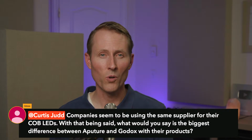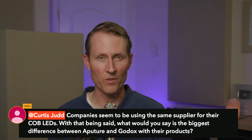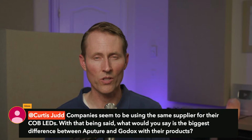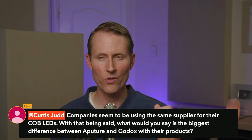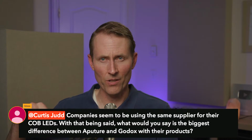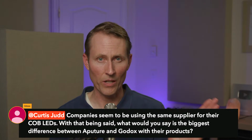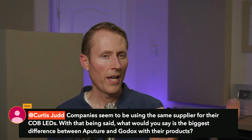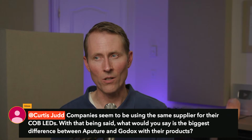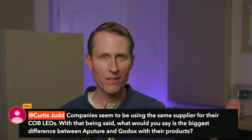But anyway, I think we're in a world now where generally the LEDs have gotten a ton better in terms of their ability to reproduce known light sources like black body emitter light sources, which are much more predictable. And certainly with fluorescent, the problem is that they're very spiky. They have multiple spikes within the spectral output that they produce. Even the really good ones still have a fair number of spikes. And so I think we're getting in a much better spot than we were before.